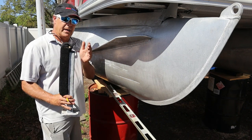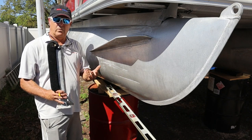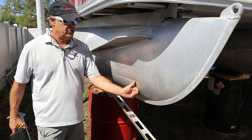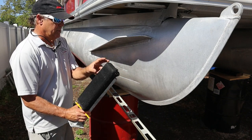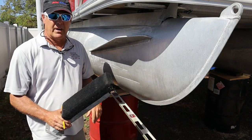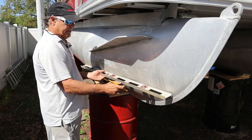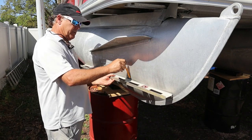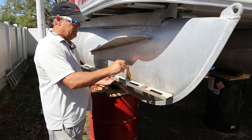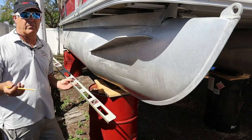This gentleman got on the wrong side of the upright — the unprotected edge — so it was steel versus aluminum. You can't put your finger down this steel edge because it's jagged and sharp. There are two marks that look like they came from two different tries with this short upright. You can see the tin-canning too: the pencil goes in about half its thickness — that's what you get from short uprights. This does not happen with long outboard uprights.